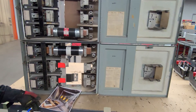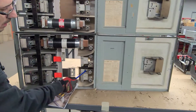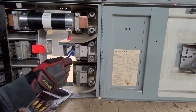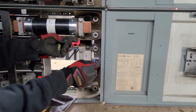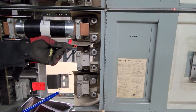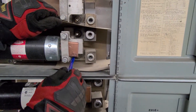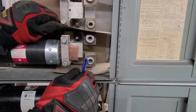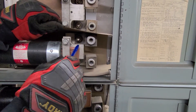The issue we're coming up with is on a vertical setup they would eliminate these lugs and put an adapter bracket here. Typically on a 600 amp it's going to be like a U-shape, connecting in the same spots and giving you two 3/8 holes to connect your outgoing bus bar. On the 400 amp they connect it on one side and it's more like an L, with two holes there for the bus bar to connect. It's a little bit wider and thinner than the 600 amp, so the brackets are a little bit different.